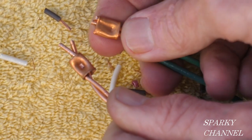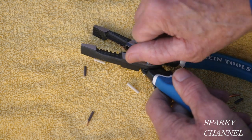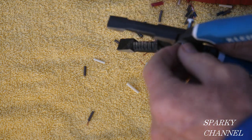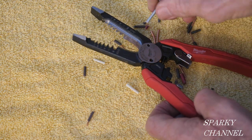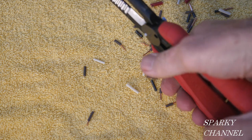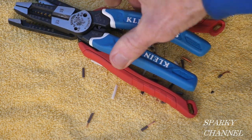Let's try cutting wall plate screws — these are 632. You've got to line up the holes just right, then screw them right in. That cuts off about a quarter of an inch, and then you unscrew it to clean out the threads. The Milwaukee's 632 cutter works the same way. The Milwaukee has a nice safety advantage with lanyard holes so you can hook the tool up when working at height and not drop it on people below. The Klein does not have lanyard holes.